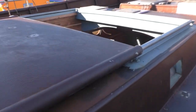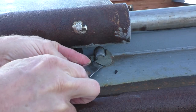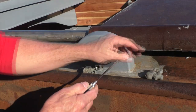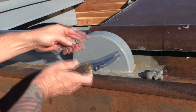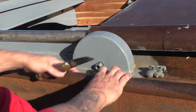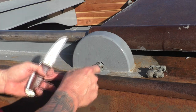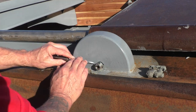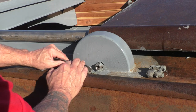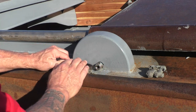Okay, the next thing we need to do is do something about these little things. Just shove some clay in here to stop water from flowing in, but we need a decent gasket around this. The other thing that's not obvious is that this deck is built as a water catchment, so this rim here holds water back. I need the water to be able to flow past this, so building something that blocks that wouldn't be helpful. I could put two drains here and take it below, but that would be more than just putting a gasket and letting the water have a little bit of room to go by.